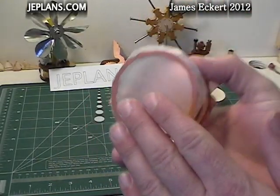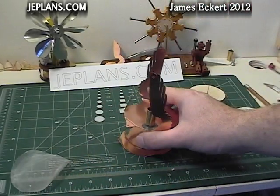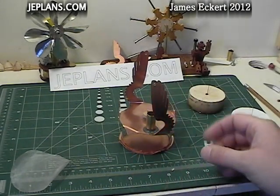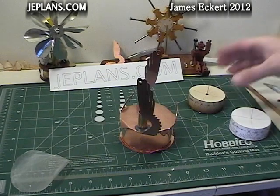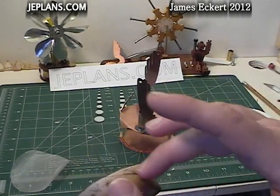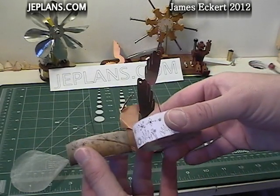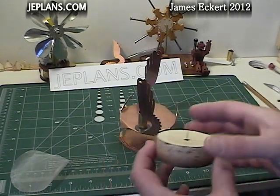Once it's set up, you simply take off the wax paper and you have a nice gasket on the bottom that will line up nicely with the contours of the piece. Ideally the bottom piece is completely flat, but sometimes you get a little warp, so if you keep it all lined up as marked, it will make a perfect seal. I had the idea to pre-bake the displacer because when they heat up in the engine the very first time, the glues and stuff burn off a lot of smoke. I baked it a little too much on high, so I made another one to try with a little lesser extent. However, this one definitely isn't going to smoke, so I might still use it.